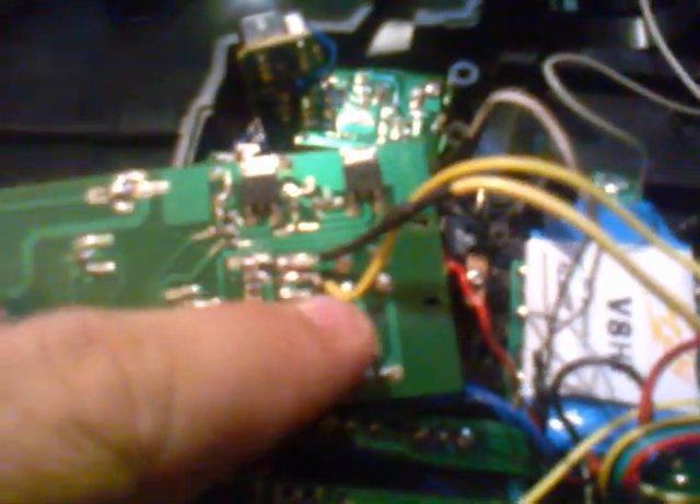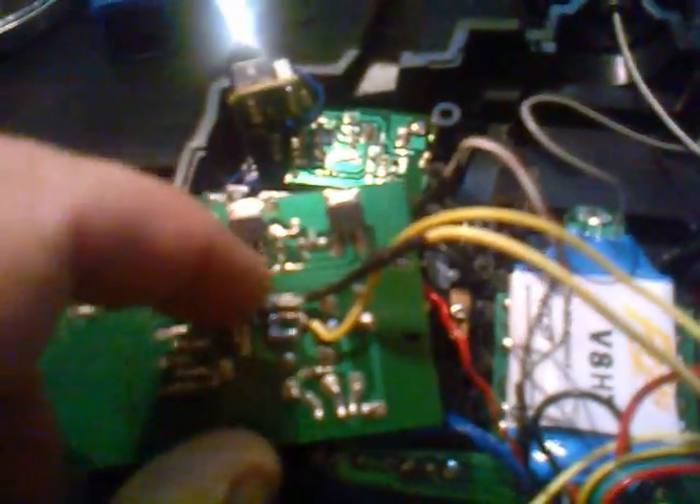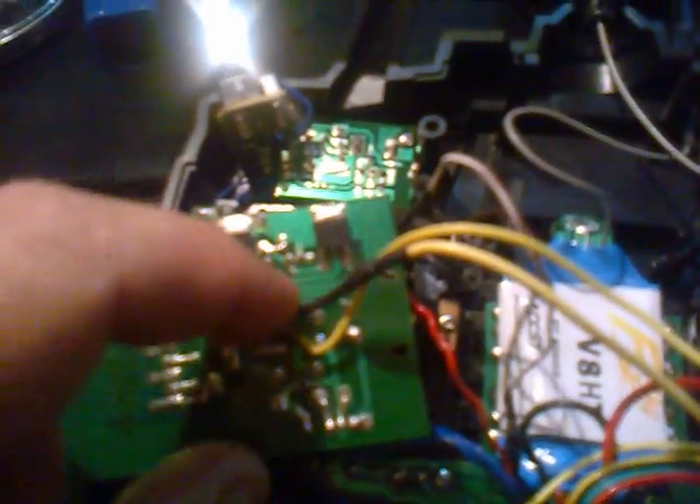So remember: power the switch middle pins from the main PCB board. Then the two output cables — one goes to the hack module power, and the other goes to pin 5 on the trainer port. When you flip the switch, the trainer port becomes active, activating the radio and sending a clear PPM signal through pins 3 and 6 to the module. The black cable is just ground — find a ground point anywhere on the PCB and solder it there.